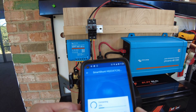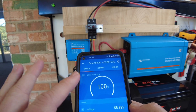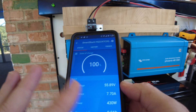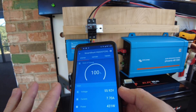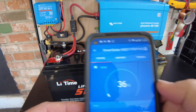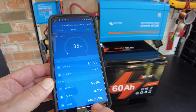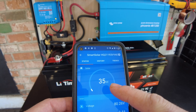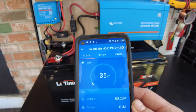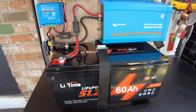We've got about 450-some-odd watts coming in. We can also pull up the smart shunt — we can see there's 430 watts going into the battery. The battery isn't actually at 100%; the smart shunt has just defaulted to 100, so the battery is still charging. This battery is almost fully charged now because the charge controller is in absorption mode and only allowing in about 30 watts.